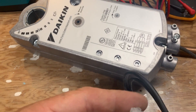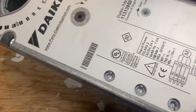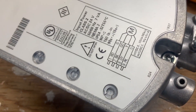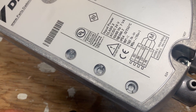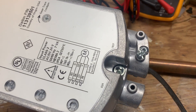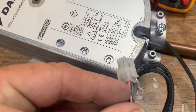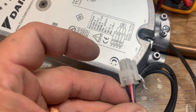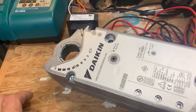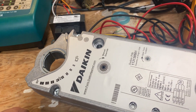I checked from my gray wire - because pink is my output and gray is my signal in - gray wire to black. DC power, with black as common. It was 10 volts at the time and the actuator wasn't doing anything. I even disconnected it from the damper assembly to make sure it wasn't in a bind. It was non-responsive, so I got the new part, put it in, and it worked like a charm.